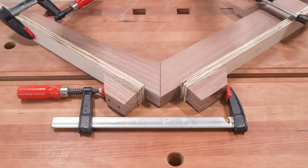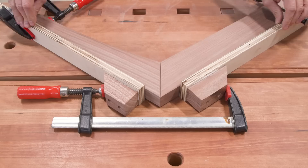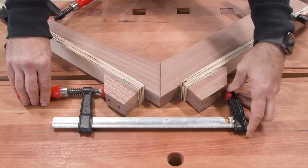The best way to handle this is to use a reusable jig like this. These are actually two pieces — they're exactly the same. You have a block for clamping permanently attached to a plywood strip with a little bit of sandpaper on there for extra grip. You clamp them to your parts and then add an extra clamp across the joint, putting the pressure where you need it.